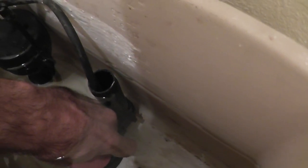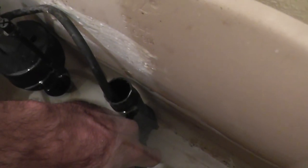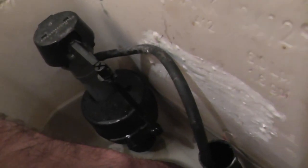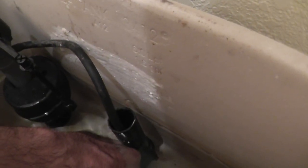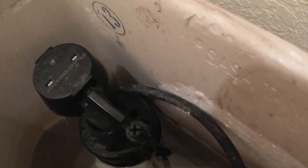To demonstrate: I'll pull up on this valve a little bit to let a little bit of water through, and you'll see that this fill valve will run every so often. You've got a little bit of a leak here — water comes down, and this valve will come on in a minute to bring the water up where it needs to be. These frequent open and closings of this valve will eventually wear it out to the point that it runs constantly.